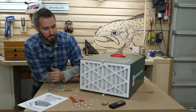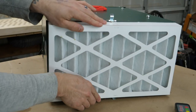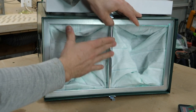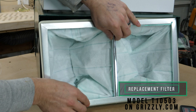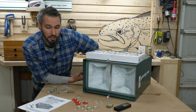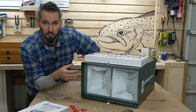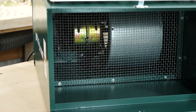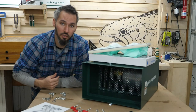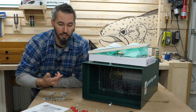This is the primary filter that just grabs the larger particulate and stops it from hitting the inner one and clogging it up. The inner one is hiding right there and it's actually two filters. That is one micron filtration and those are also replaceable — the manual says you can get them on grizzly.com, so check those pretty regularly. Beyond that is what they call a squirrel cage style motor system — the impeller that actually pulls the air through and exhausts it back into your shop.